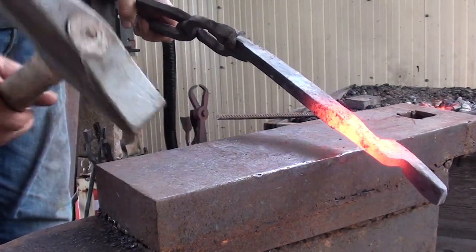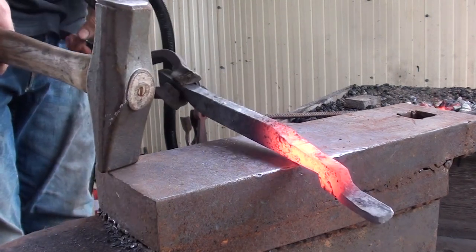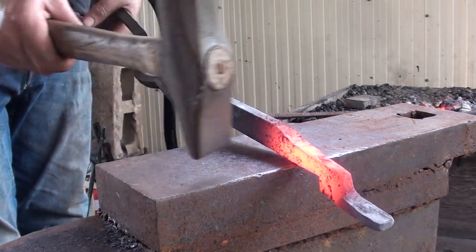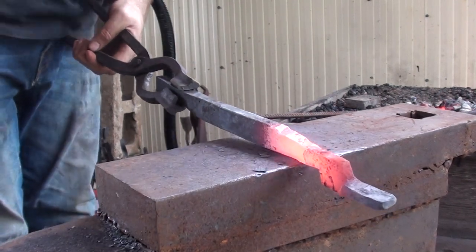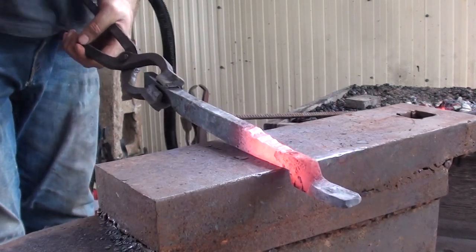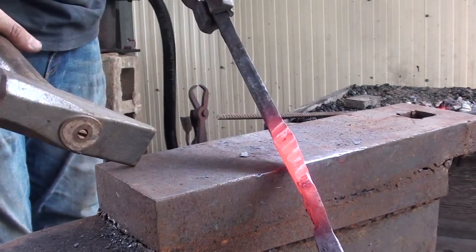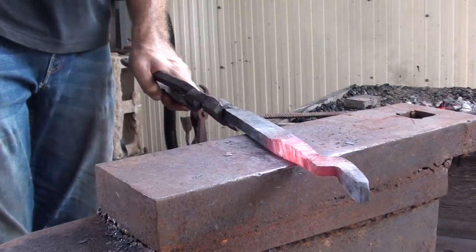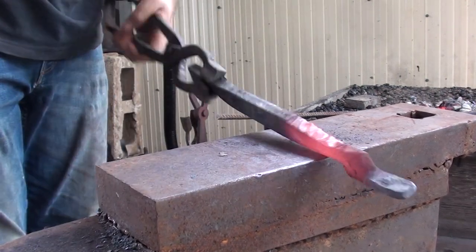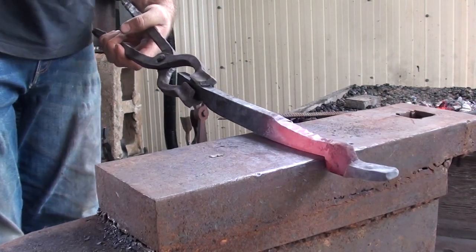Now, if you have access to a cross-peen hammer, it's really good. This is a very aggressive way of drawing out. But basically, over the edge of the anvil with the cross-peen, just... basically, work it down, and then take out those hills, bring it down, back to flat.